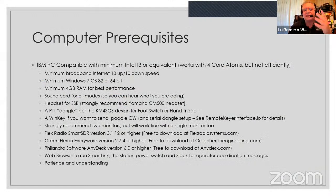What you need for a computer: I don't read the PowerPoints, I assume you all know how to read. A fairly decent computer is helpful, especially if you're going to run things like FT8, because FT8 uses processing in the computer. You have to connect to the rotor controller, handle FT8 graphics, decoding, and encoding, show the radio GUI, and move audio back and forth. There are a lot of moving parts, so a fairly powerful computer — like an i3 — is probably the minimum.